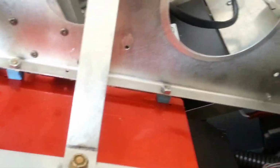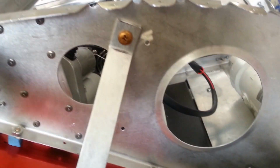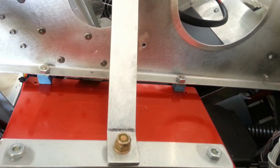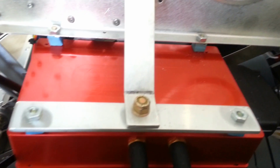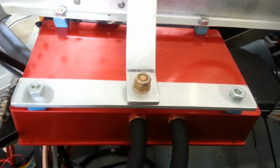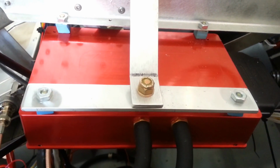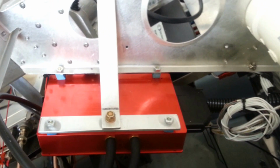On the S-19, what we did is you get your panel and the plane right here, and as you move back these bulkheads to the second bulkhead after the instrument panel, we used the ledge of the stringer here. We drilled 2 holes, and then we made a crossbar, and didn't have a lot of threads here, so it was one place we cheated a little bit and put Loctite on it. But in any case, the computer is securely attached there.